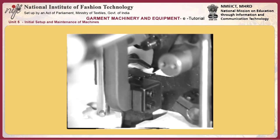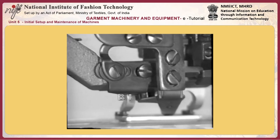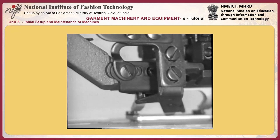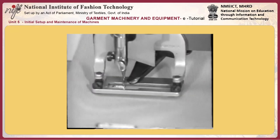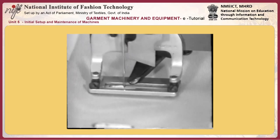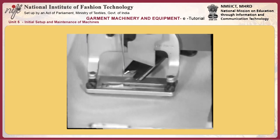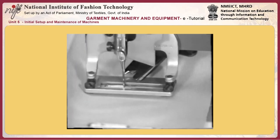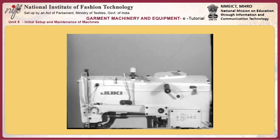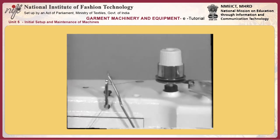2. Neatly roll in the needle thread in the seam at the beginning of sewing, increase overedging width with E. If the bar tacking width is set to 3 mm or less, the needle thread rolling-in performance of the machine can be more or less degraded. It is better not to reduce overedging width more than necessary. The lower the needle thread trimmer is positioned, the better the needle thread rolling-in performance will be. Position the needle thread trimmer at the lowest position as long as the needle thread trimmer does not come in contact with the work clamp foot and moves without a hitch.